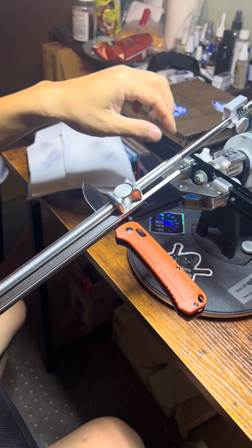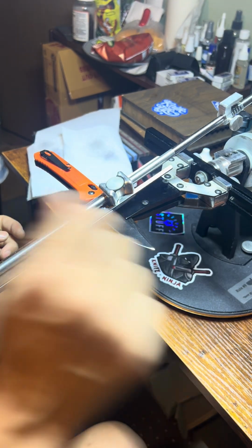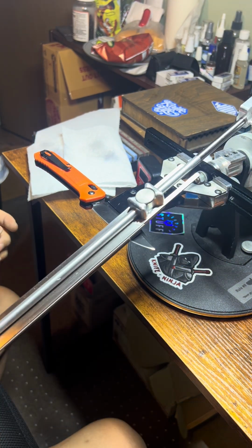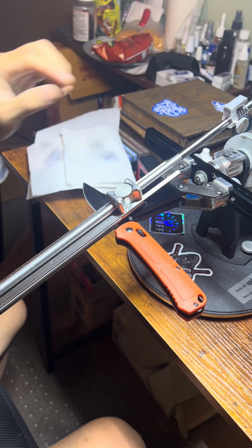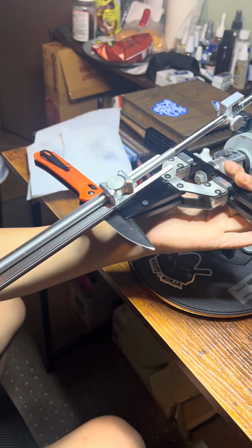But what I'm doing is I'm just flipping the burr back and forth. I'm weakening it, kind of like when you get a tin can with a pop lid. When you go back and forth with it, it'll eventually come off. The cleaner you remove that burr, the better your ending apex will be. I think, at least. That's my hypothesis.